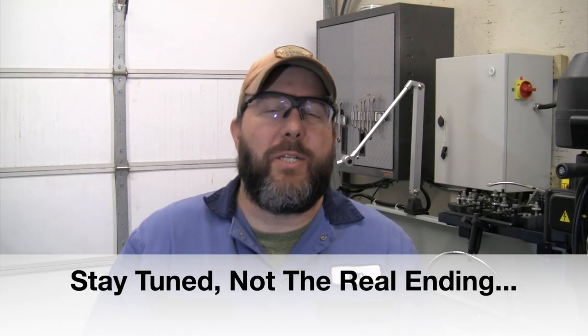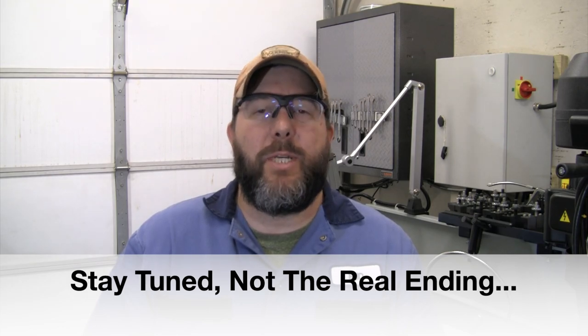Well, YouTube, I appreciate you watching another video here in the Blades to Be shop today. Overall, fairly successful, but you know, we got our handle slabs nearly complete. Definitely got the look we're going for with those, with that Scotchbrite wheel. And as we saw, we got a little bit of work to go with that Tapmatic. I think I broke a total of four taps today, three of them with the Tapmatic, and then I broke one by hand after it only hand tapped three holes with a brand new tap.